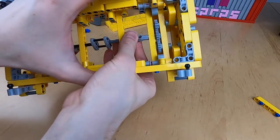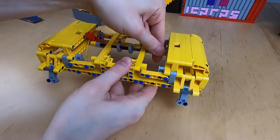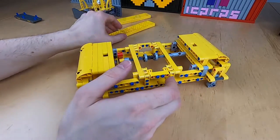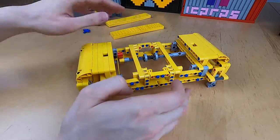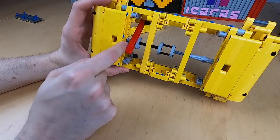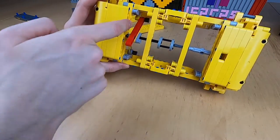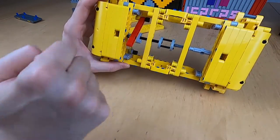Put it back together and see if you have fixed your assembly. If gravity is not enough to pull it down, you can add more parts to the weights in the sides. You can also remove a layer if you think it is too heavy. You can adjust the lift arm by moving the pin holding the silicone band up to add friction, or put it down in the bottom part and have the silicone band go below the center axle to reduce friction.